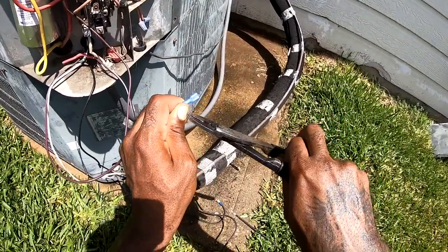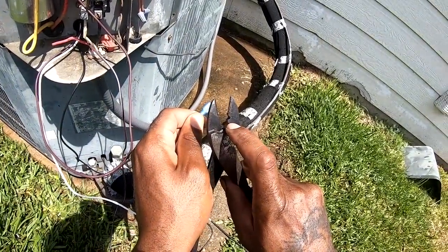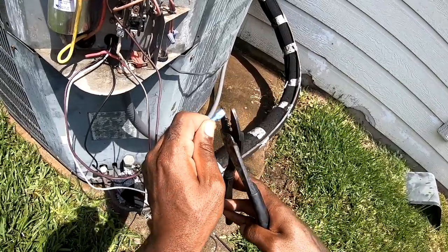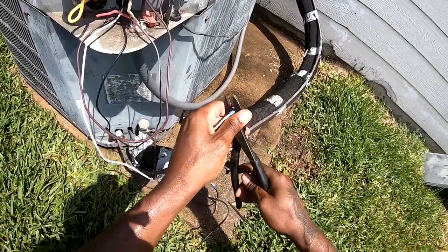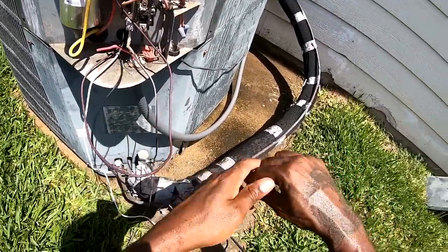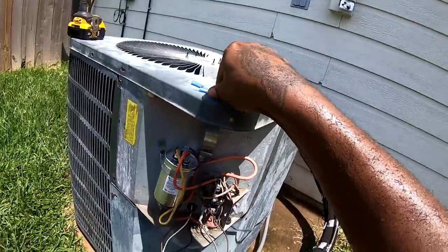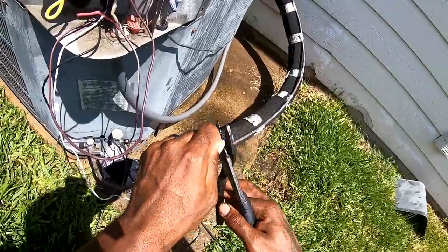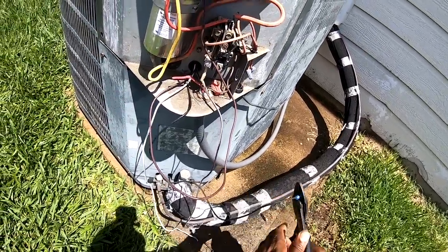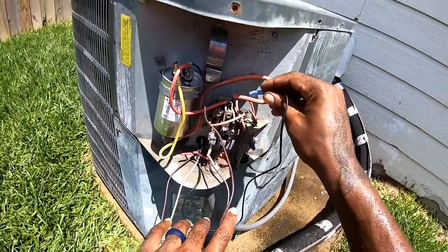Yeah, so these things have a little crease up in there. I always like to put the crease on the smooth part so it'll fold down evenly. Now make sure my wire is good and crimped. One of the fundamentals I was taught early on. Stuff like that can come back and haunt you if your wire slips off. So I'm gonna put this one back on the black.